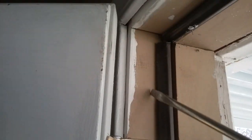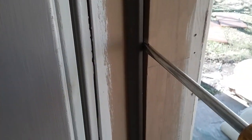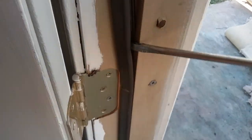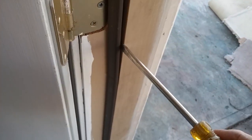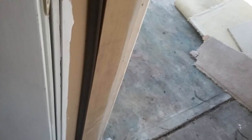To get weather stripping out, you just take a good flat screwdriver — don't pull on it or you can rip it. It just comes right out. The best thing to use to cut it is just wire snips or something of that sort.